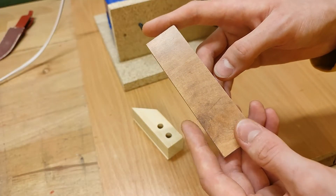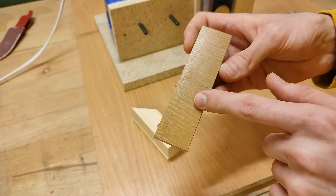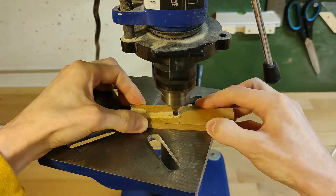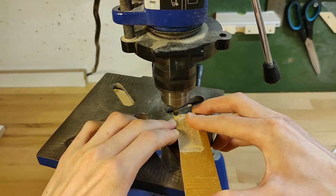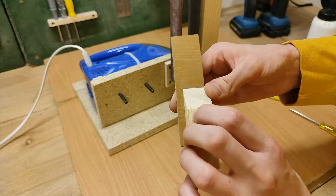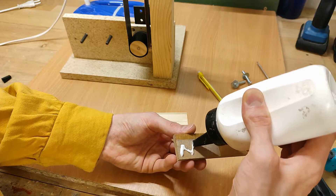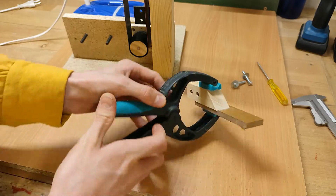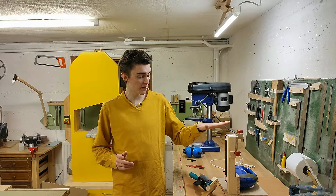The only inconvenience I've got with this stuff is that the finish on the back is also smooth and shiny, which means glue won't stick to it unless I remove a very thin layer of the surface. I'm gonna do that using my trusty old technique of putting a Dremel router bit in the drill press to machine it down by pushing it back and forth under the router bit. Now it fits nicely onto this block, which has got a small ledge on one side to facilitate positioning. Instead of waiting until that's dry, I could just as well start making the table.